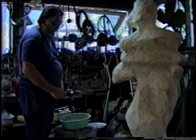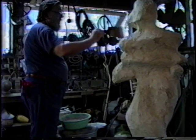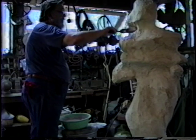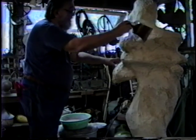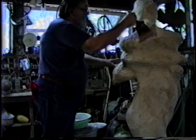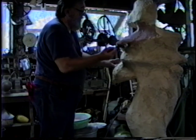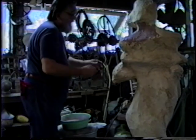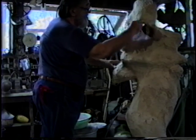Now, when you use a brush, use an artificial bristle, because the cement will eat up an organic natural bristle, because it's a very strong base. It's like lye. So what we're doing here is this sort of fills in any deep cracks and gives a homogeneous, at this point, rather rough surface. This covers up a lot of errors. And nothing I do is terribly high tech.